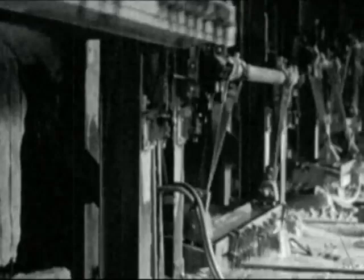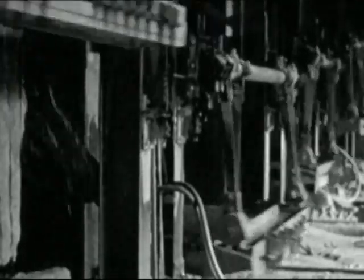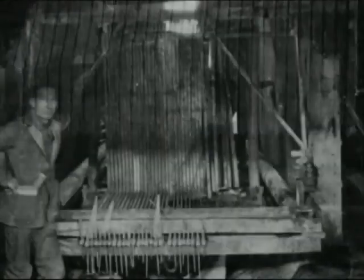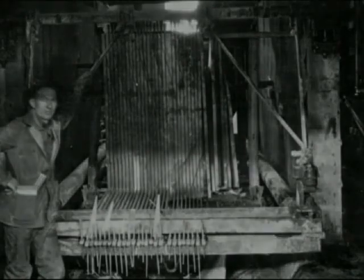And the sand is actually what did the cutting, because the blades had no teeth on them. Just steel blades started out about 6 inches wide, and they gradually wore down until some of them were only 1 inch wide. That was very interesting. A very slow operation, and it might take several days to cut through a large block.